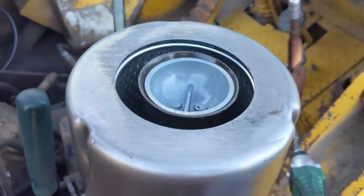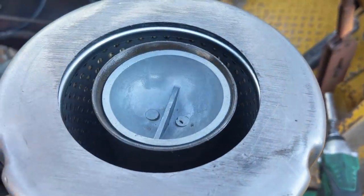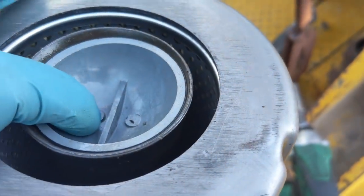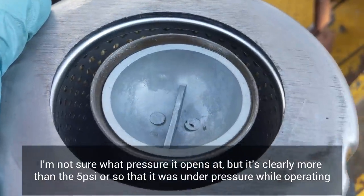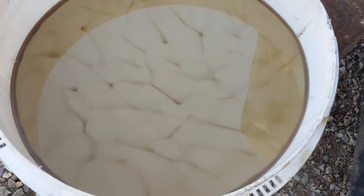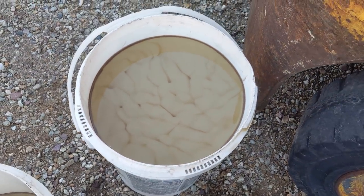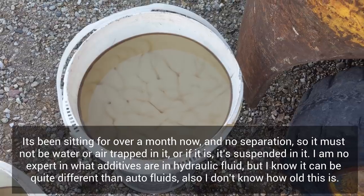The bottom of the filter - this is a cool little piece. This piece here is attached to a spring on the other side and it's a bypass valve. So if the pressure inside gets too great and the filter can't push the fluid out, it'll bypass the filter and get dumped out of here. I checked the tension on it - that looks good. One thing that's interesting: the oil hasn't run in over a day and it looks about the same as before - still that mocha color. I'm going to let it sit for a couple of days and see if anything separates, if I can get any water floating to the top. Usually water flows to the bottom of oil within an hour or so - you pull the drain plug and it comes out water first, then oil. That doesn't seem like the case here, and it also doesn't seem like it's frothing up from air.